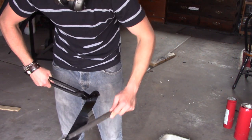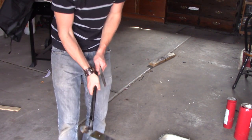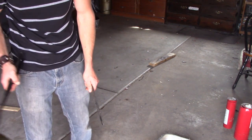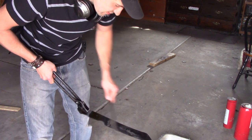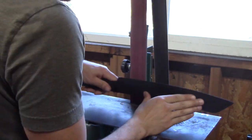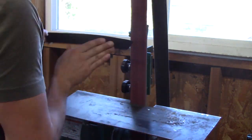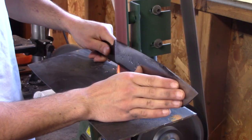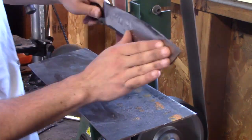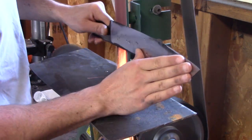Here I'm just testing to see if the file skates over the blade. It skates over, sounds like a glassy sound, doesn't catch, doesn't grab onto the blade at all — you know you have a hard blade. After that I temper it in the oven. I did two two-hour cycles at 450 degrees. This is 1095 steel, and I found that it gives a really good temper on the blade.